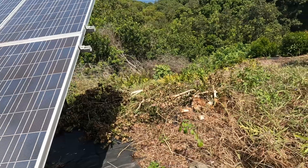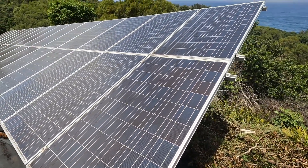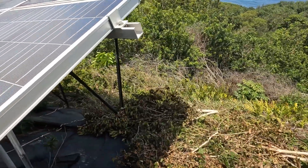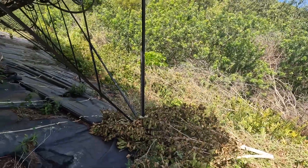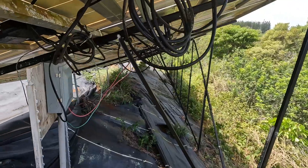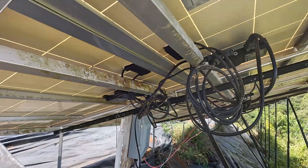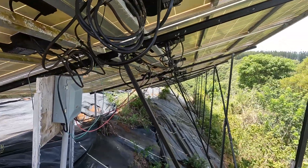I'm making my way down this ridiculously steep slope to get to it. The main supports are galvanized steel T-posts — the kind you see holding up barbed wire fences everywhere — pounded into the ground with no additional concrete or even gravel, bolted to one-inch square anodized aluminum tubing to make up the framework, with standard unistrut channels, T-nuts, and panel brackets.